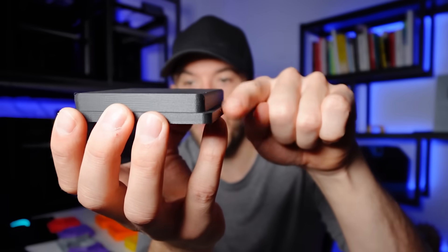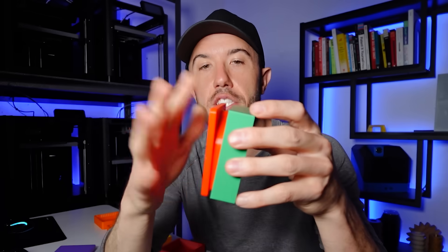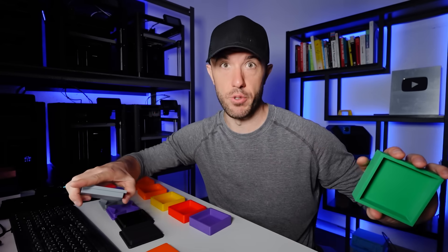A different material, a different resolution, a different infill, a different machine, a different nozzle size — all of these change it. It is almost impossible to rely on printer settings to make sure that the same files printed on different machines in different situations all behave exactly the same, unless you very intentionally design the parts appropriately so that they do.